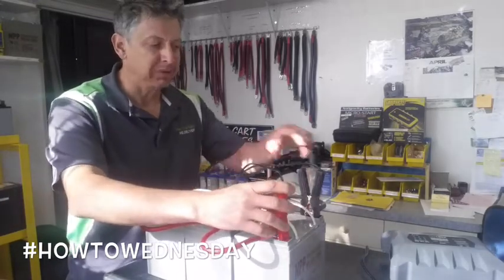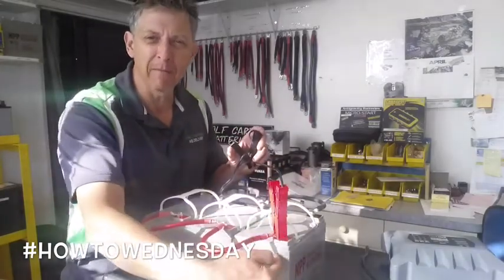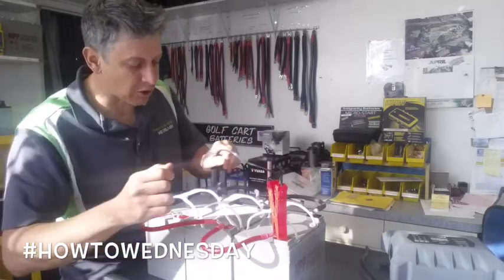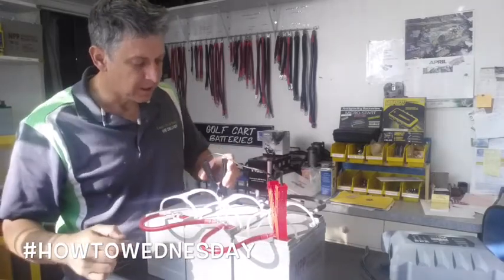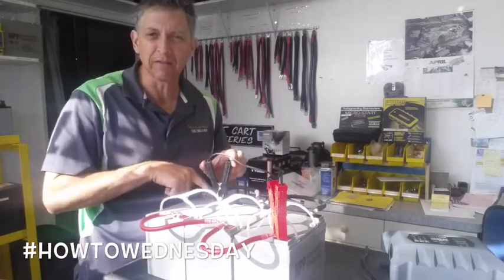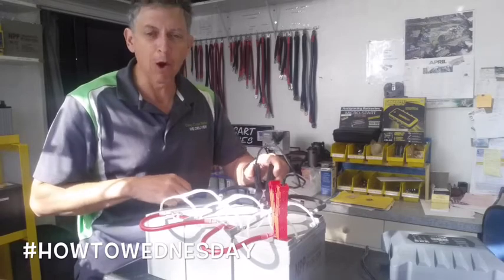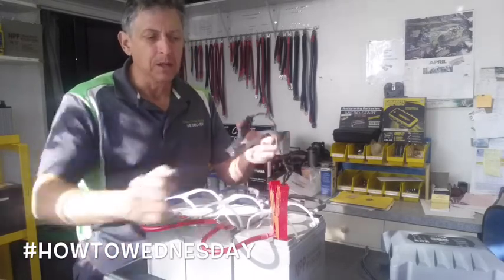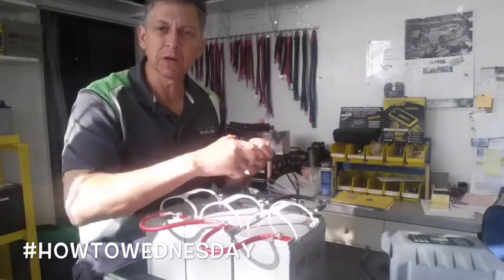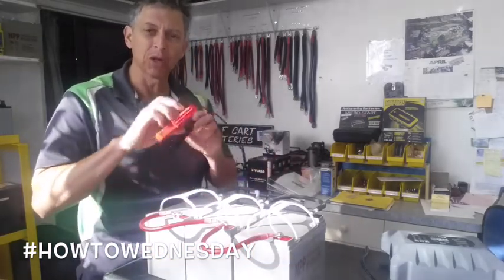To correctly place the charging for your battery bank, take the positive and connect it to the very first point of the bank, then take your negative and hook it to the very last battery in the bank. Effectively, charging starts at the first battery and works through battery one, two, and three by placing the negative at the very back. I've seen cases where the negative was placed in the middle with the hope that the back battery would get charged — it's not going to work. Charging is simple: select the very first point for positive and the last point for negative. You can also identify these points because the vehicle loads connect at the beginning and exit at the last battery. Your charger follows the same position.